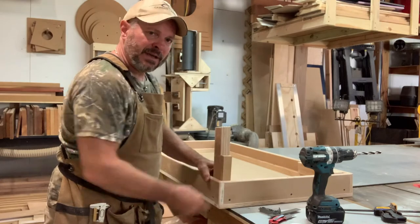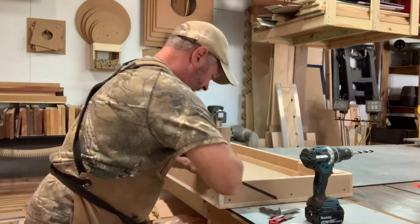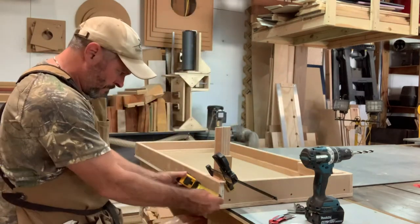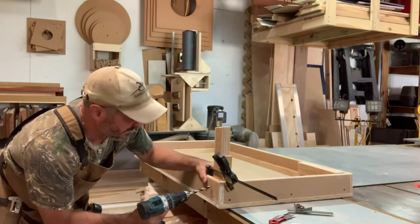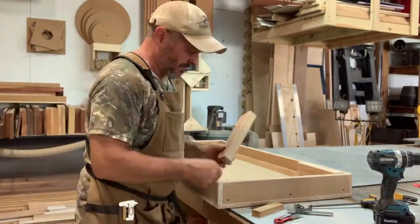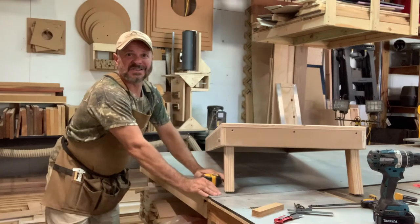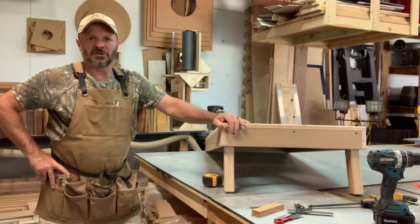The inside space I'm working with is two and a quarter inches thick, so I came down one and one-eighth inch and in two and five-eighths to the center of the leg, with five-sixteenths hardware. In the full open position it should be 12 inches on the money. I'll get the other two done and get these over to Melissa — I think she's going to come out and do some painting. We'll go check on her now and see how she's doing on those bean bags.